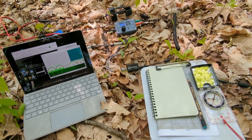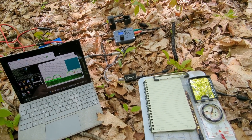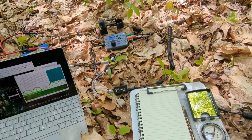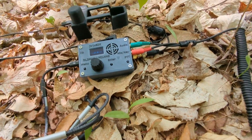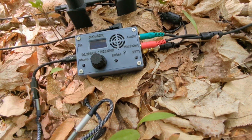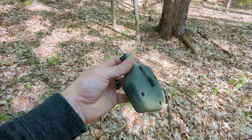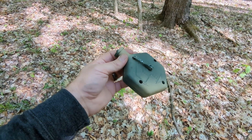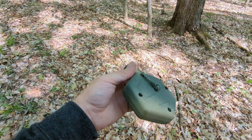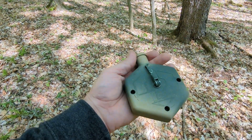It's a little bad on the audio to receive, but you can use headphones to overcome that, and you can also use a separate microphone — same jacks that the DigiRig Mobile is connected to. Taking this antenna back down is as easy as just disconnecting the coax, the transformer, the rope, and then winding it back into itself, so it's pretty convenient and pretty quick.